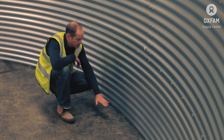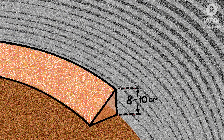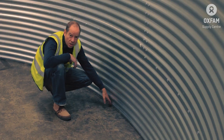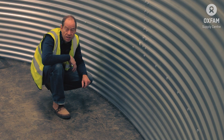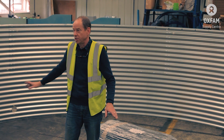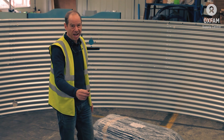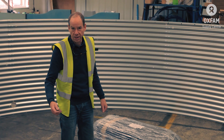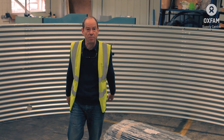When you're finishing the base, prepare a bevel or a small ramp with sand or a dry mixture of sand and cement. Pull it up to about eight to ten centimeters — this is really to stop the liner from forcing its way into the corner. If there's any settling on the base, the last thing you want is for the liner to start trying to creep out underneath the steel. So you've got your base flat, your little bevel around the edge, you're all level and happy with your steels. Last thing to do is check your base and make sure anything sharp — any nuts or bolts that have fallen in — is removed. Get anything out that could be in danger of puncturing the liner, and then get your people out of the tank.